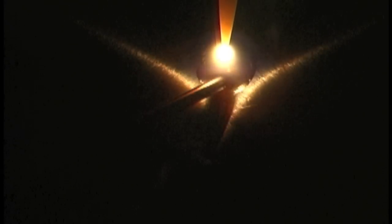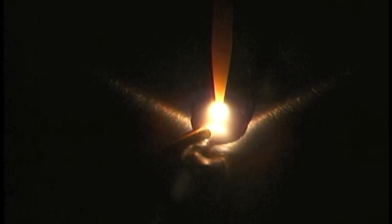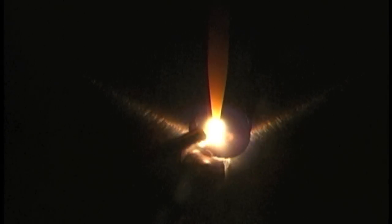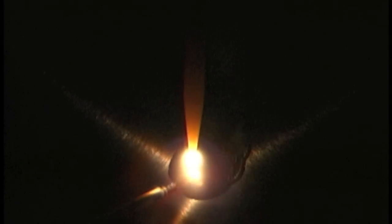This is 32 thousandths wall thickness, and if there's any gap, that pulse rate of 33 with the settings like they are gives me an extra second to get rod in there before it just key holes out and I get a hole that I have to fill in.